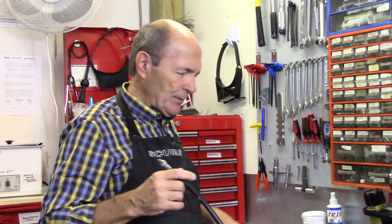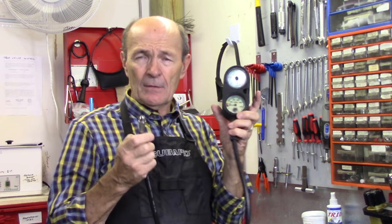These hoses have an extremely small diameter. The inner hose is very, very small. What's with that? Well, first of all, air doesn't go through that hose. A very little bit of air goes into the hose when you first put it on the tank, and then the pressure of the tank is transmitted through that air to the pressure gauge. That's it. An almost immeasurable amount of air makes that gauge go up to 3,000 psi. That's all. So that's one reason why the inner diameter is very, very small.